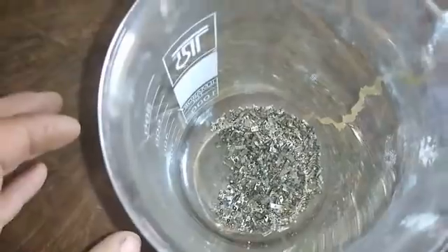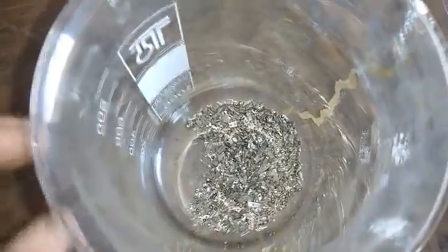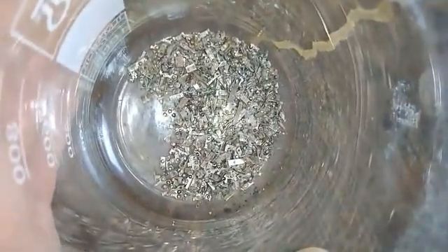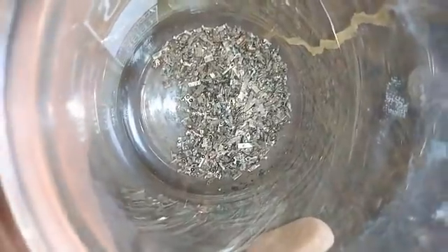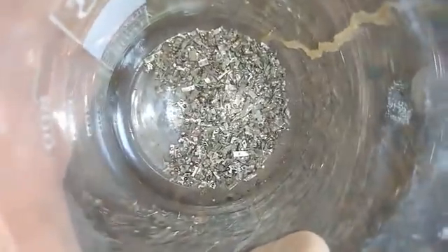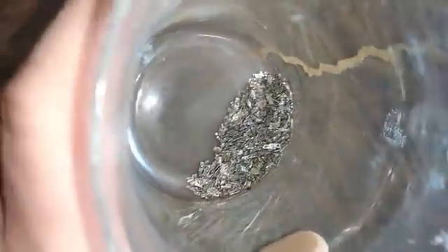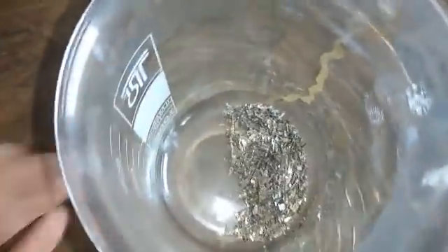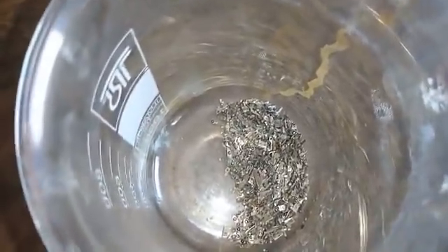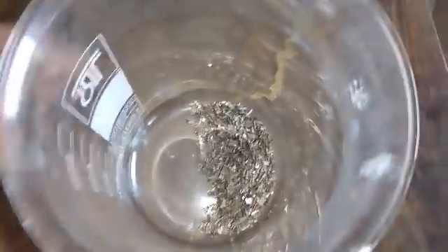So what I'm going to do is little by little add some hydrochloric acid, then add some sodium nitrate, little by little, until I dissolve all the base metal and I'm left only with the beads — silver beads, mixed palladium-silver beads, or clean palladium. They will not be attacked by the Poorman's Aqua Regia. It sometimes dissolves just a small micro amount of silver, but it's not hard to recover that silver from Poorman's AR — just with cold water or add a little table salt. No problem.